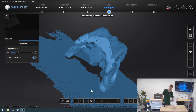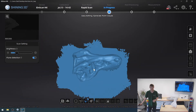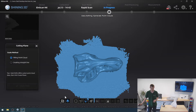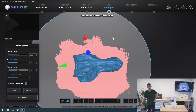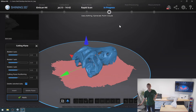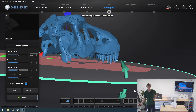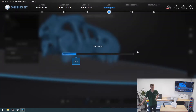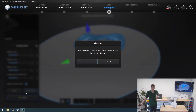I've covered everything on the top, but what about the underside? I'll have to do that in the next step. For now, this right here is my scan model. What I will do now is click the cutting plane tool, then hold down shift and select some of the table that I scanned, because I want all of that table to go away. It basically selects different areas of points, then I say create the plane and move it a tiny bit to adjust. It shouldn't cut away any of my T-Rex skull — maybe a tiny bit at the tooth — but all of the table will be gone. Click apply, and now we've gotten rid of all of that unnecessary table.